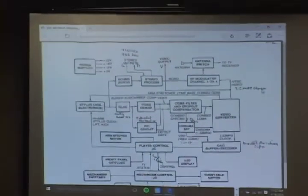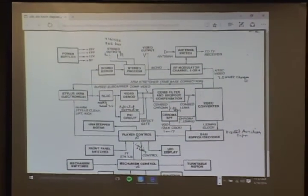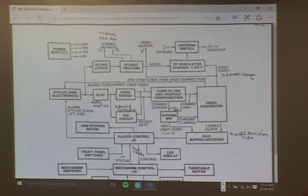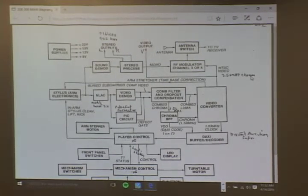If you're very good at soldering and you know what to do, like John, you can just desolder and put the new one in. I happen to take the green board off, uncoil the two wires, and then recoil the new ones back on, because it's just easier for me. I'm good at soldering, but clearly not enough. When it's too hot, you melt the plastic, and it ruins the little coil that's on the post.